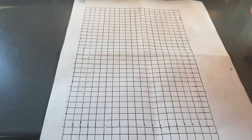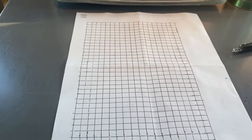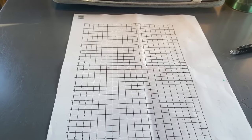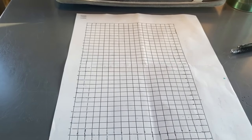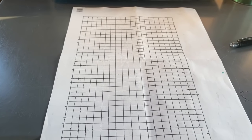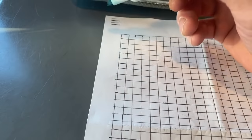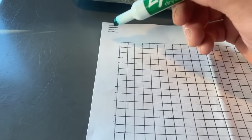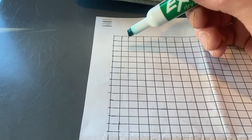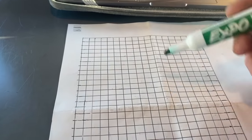So now I know that I've got 1,200 square feet of floor to cover, and I want to divide that up and stay less than 500 feet. So I'm gonna say a 400 foot loop works out perfect for this size. So that's what we did. We did 400 foot loops, and we started right here, where our manifold's gonna be.